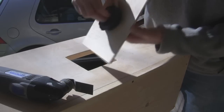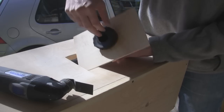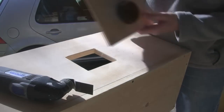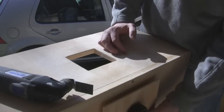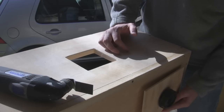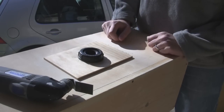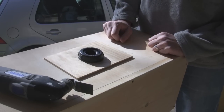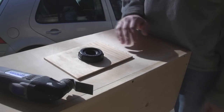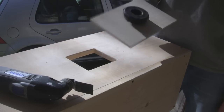There's a gasket here where the pond liner goes between the gasket and the bulkhead fitting — that's how we keep a watertight seal. We have to do the same thing on the bottom for our overflow. As you know, living in city apartments, the biggest problem is leaks. We want to prevent water from overflowing the top and going into the downstairs apartment. So next up, let's make that overflow.